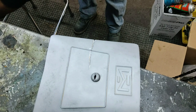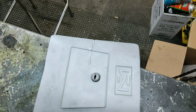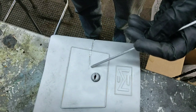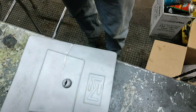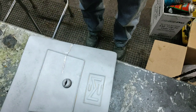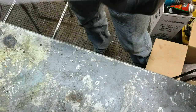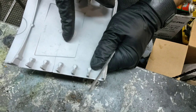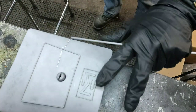Hey fellas, how's it going? I got you angled down on this plate — this cover plate. It's got a nasty crack in here, and what I did is I took my Dremel and I beaded this crack, so I could get material in there. This is aluminum rod, mixed with a couple other metals, but this should work. If not, no big deal — I can do some metal finishing. I want to fill this crack up.